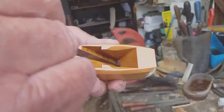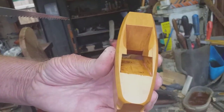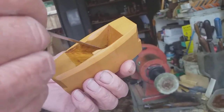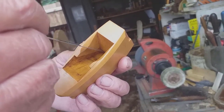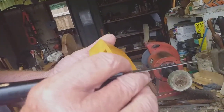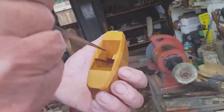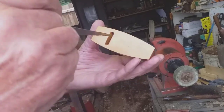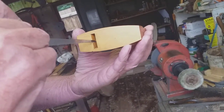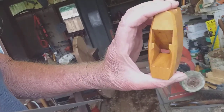Then you do that face there, this face here - chisel that out to your three-quarters, like that. That 63-degree angle - I must have set that up to explain it in the book, because normally I just guess. It's to allow the shavings to come out, so you want room in front of the iron and the wedge for the shaving to come out like that.